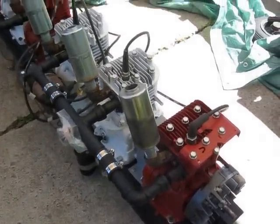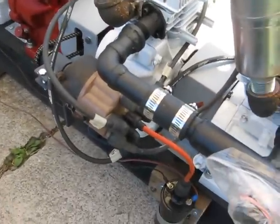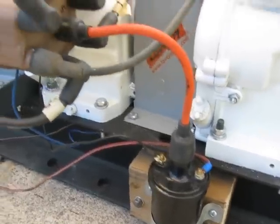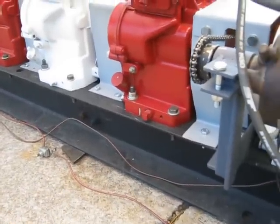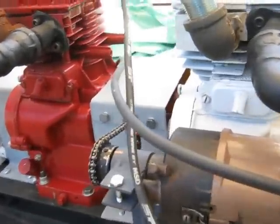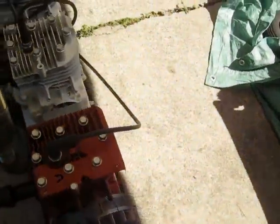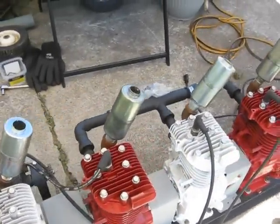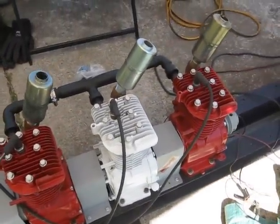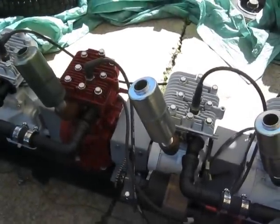The entire ignition system is installed now. The cylinder heads are tightened down, spark plugs are torqued, and all the spark plug wires are run. You can see my butchered-up coil mount there - it seemed to be the simplest way to do it. The power wire is running there and I think I'll use a non-automatic type battery charger as the power source for the ignition. Chain is running through the chain guard. I've tested the spark to make sure it's working right and connected to all the correct cylinders. Some wires are a bit long but I'll electro-tape them to different things to make sure they're not going to get hung up or short out on anything. Mainly just have to do the fuel system now.